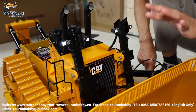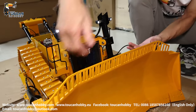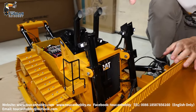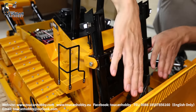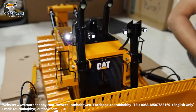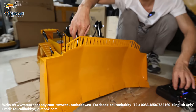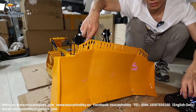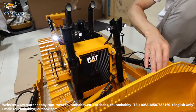One thing about this blade: it can tilt forward and backward, and can tilt left and right. What is smart is these four cylinders. These two are for lifting up and down, and they are controlled separately. I can lift the right side with this cylinder on one valve, and lift the left side of the blade with the other cylinder.